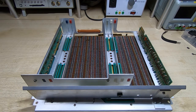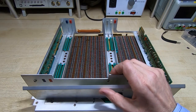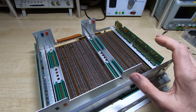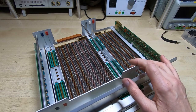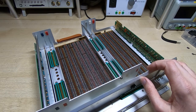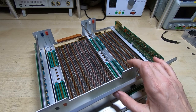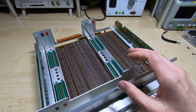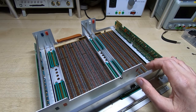Today I'm back working on the HP9100B. If you haven't seen the previous videos in this series, these are transistor-based calculators — quite complex devices, very interesting in terms of their electronics, and a very interesting memory and ROM system. I had two of these machines to repair; the first one I repaired, found a few faults, and it's been working flawlessly ever since. This one's been fighting me a bit — it seemed to be working superficially, but when I left the self-test running I'd come back an hour later and the machine had locked up, which is fairly typical for this type of machine.